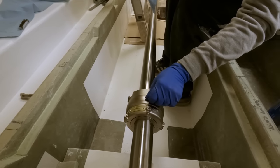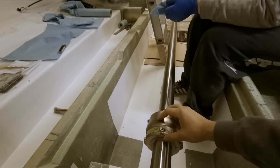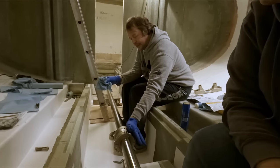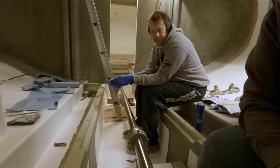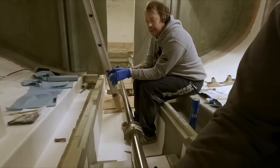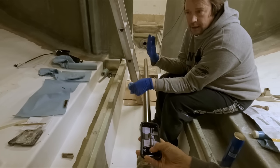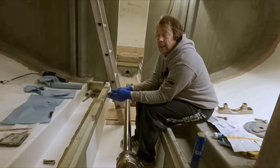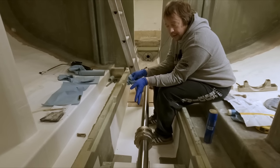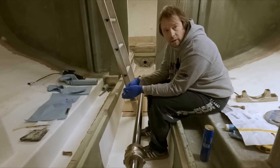It feels super smooth. Yeah, boy, that shaft is gonna spin nice, I think. A lot of boats have these, so we're pretty excited to have them. It's gonna be a lot less worry than the Babbitt bearings. The Babbitt bearings work great, but they're really not the best application for a marine because technically Babbitt bearings are supposed to be lubricated with oil as opposed to grease. And on boats, there's no way to put an automatic oiler in here. I mean, well, you could, but you would have to refill it. And then, of course, you're going to have oil in here all over the place.